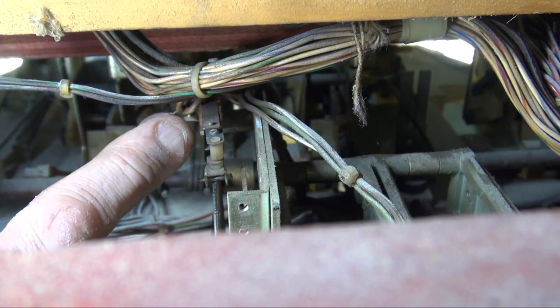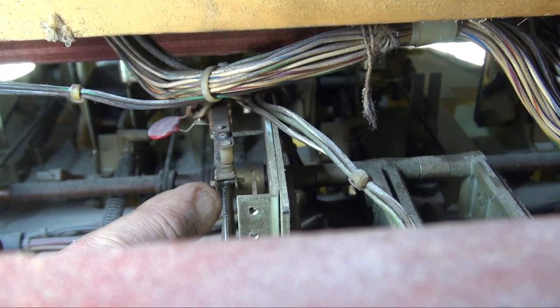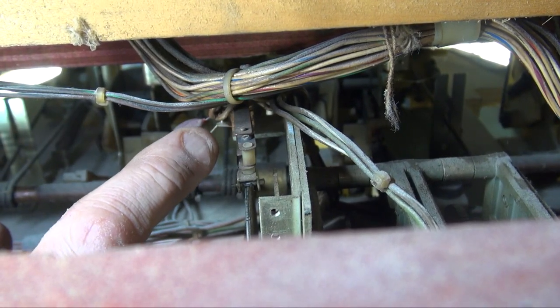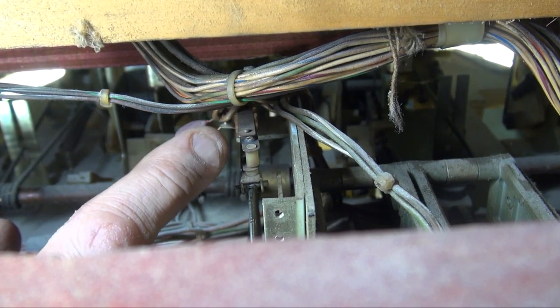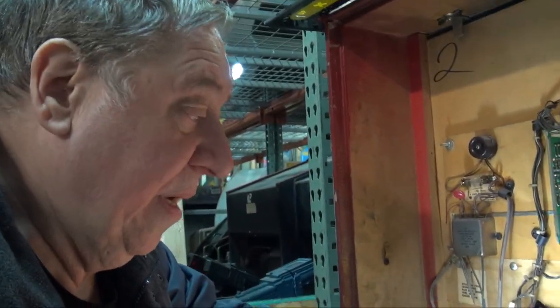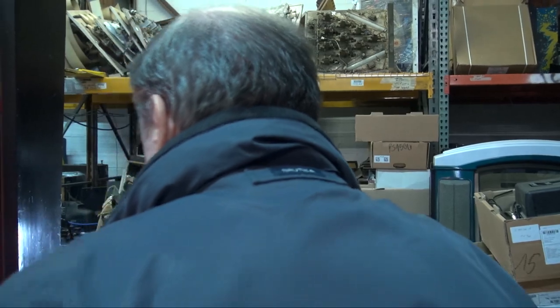They're both designed, they have two identical switches. Identical. When this goes up, both switches are touching. They both drop off. They did this to dissipate the voltage between the two switches so the switches last much longer. Okay, that's why they do that. So it's a nice long life. Okay, so that's part one of our learning session today.